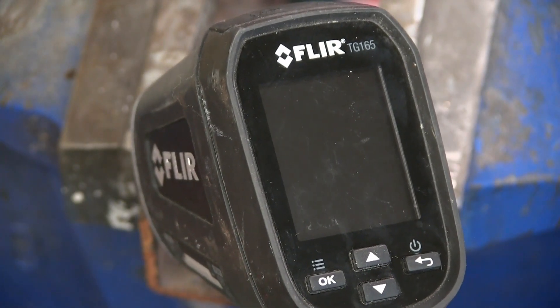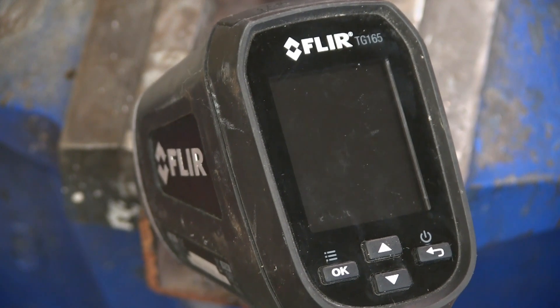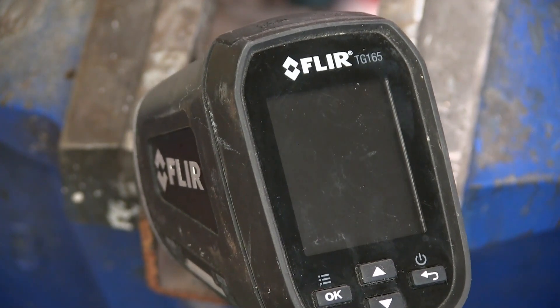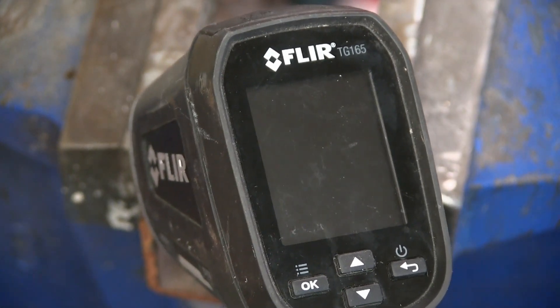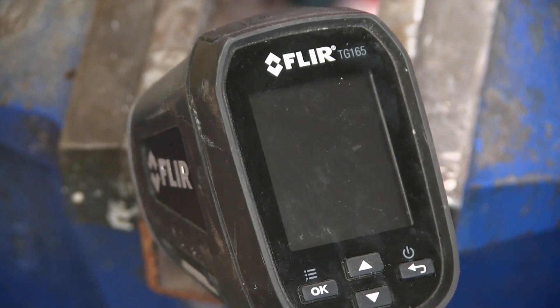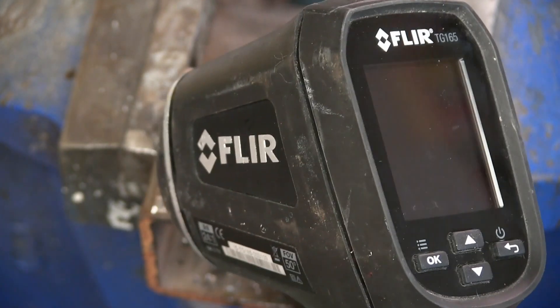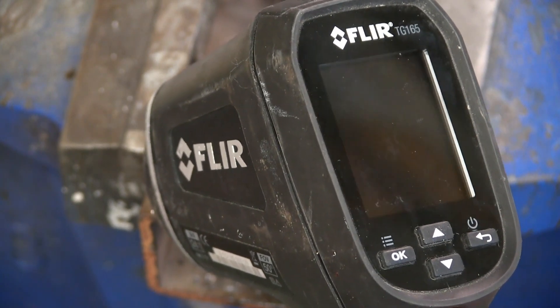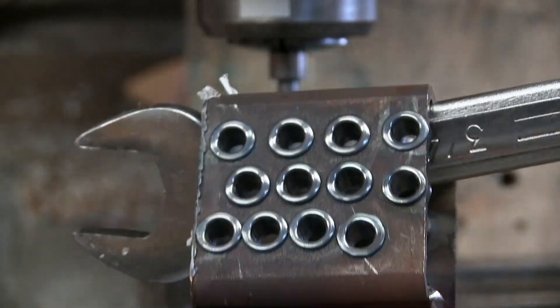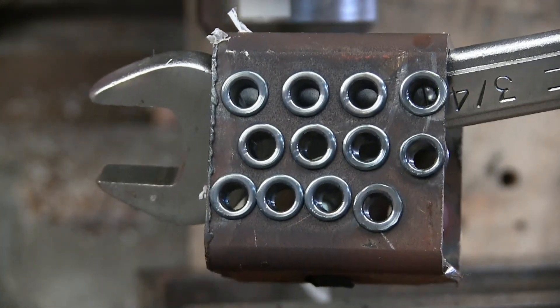You were wondering about the thermal imagery — it was only showing 200 degrees. Well, science — it's hot, but obviously not a thousand degrees, which the metal actually was. The range on this isn't that high, it was far away, and this is not an accurate tool for specific measurements. It's more a good troubleshooting tool for seeing where the hot spots are, not determining how hot the hot spot is. You've got to take these measurements with a grain of salt. What's left? Just the gratuitous use of red-hot tools poking through steel to increase our clickbait factor. Those poor freebooters on Facebook need some whack-off fodder. If nothing else, that's a cool look for speed holes. Thanks for watching — keep your dick in a vise.